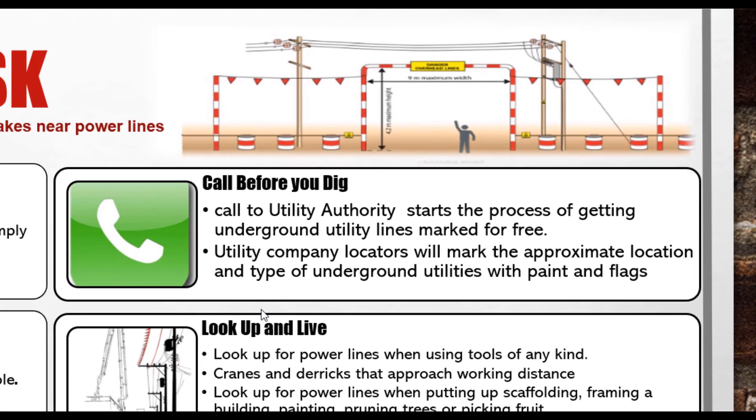The fourth point: before performing any excavation work — and this is not only about overhead high voltage; I may also work near underground utilities. So before excavating underground, you must contact the underground services authority responsible for electricity and any other underground services, and obtain the appropriate permit. Confirm that all underground utilities and high-voltage cables present are isolated or permitted. This is the key point: contact, coordinate, and arrange before any digging.